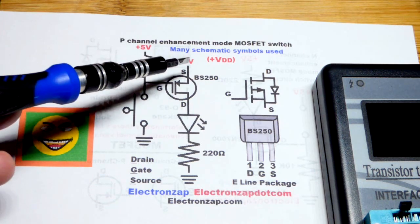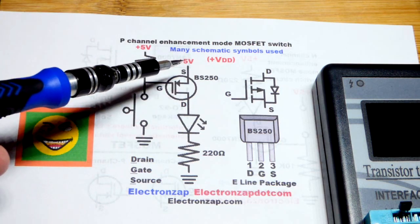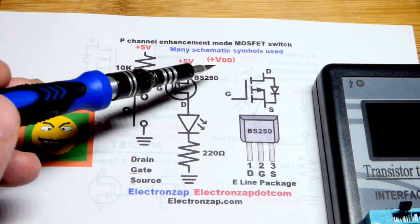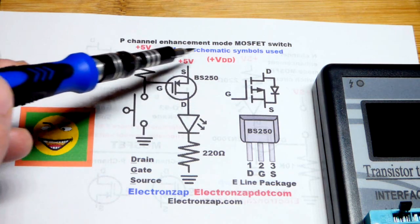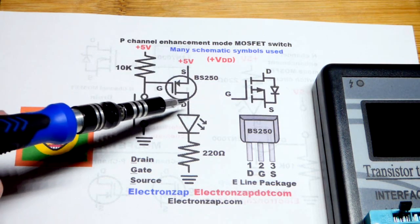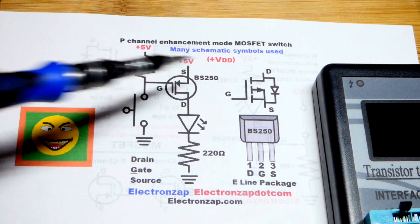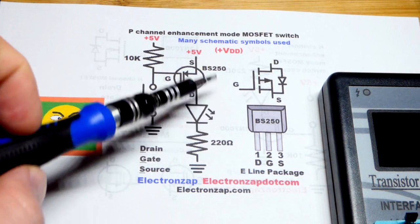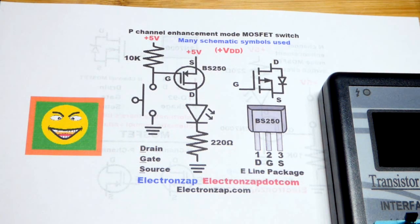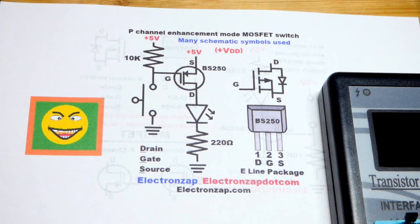That's what we're going to use here. With the N channel MOSFET, the drain is on the positive supply, and so if there's no number on there, you get VDD for the drain side. When you're using the PNP, or the P channel enhancement mode MOSFET, I mean, then the drain is on the more negative side, but still you stick with using VDD to indicate the positive supply. So you'll see that from time to time, and so that's what that means. If it's VCC, that means it's a bipolar junction transistor, because the C, the collector, is towards the positive side of the supply. So they do that a lot if there's no number to give you.